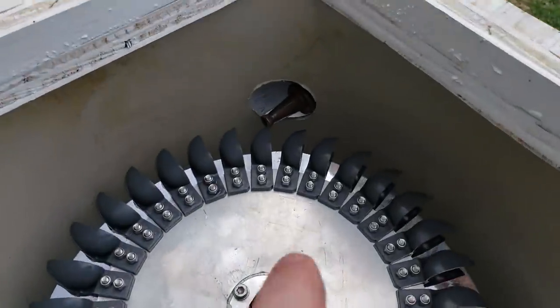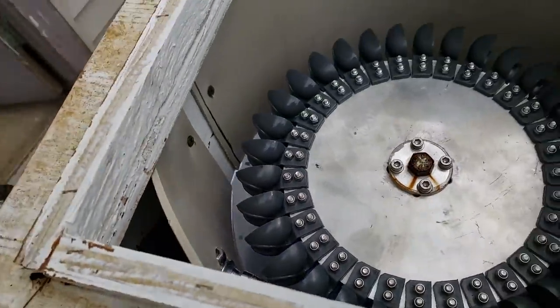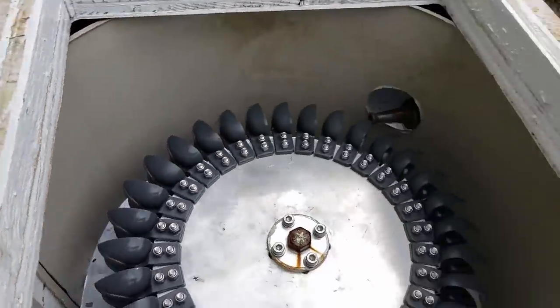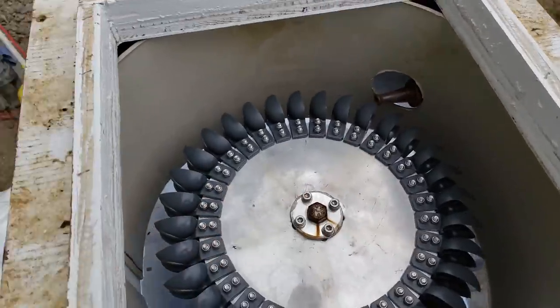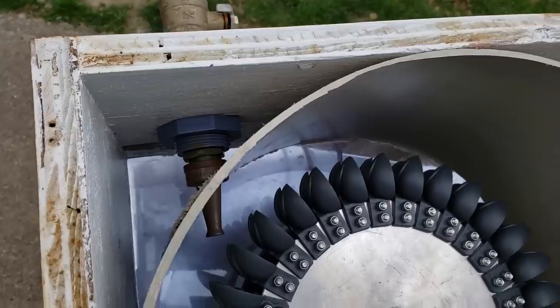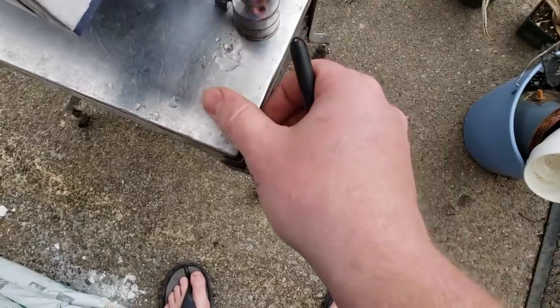Set up on my outside workbench. One thing that does suck about the liner is it's hard to change the nozzles - you can't get your fingers around there to put any torque on it. The nozzle is contacting the liner. I did screw the liner to the housing. There's some sort of debris in there blocking the nozzle. I don't have a really fine filter on the intake, just a coarse filter to keep out large debris that would clog the penstock. Here's a clearer view without the funnel attached - and that debris was a rock.